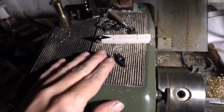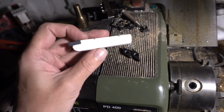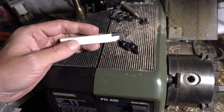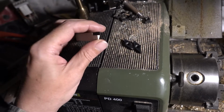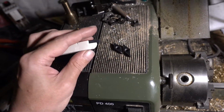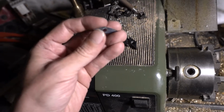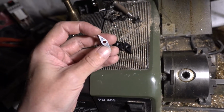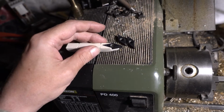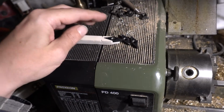Well, I was tinkering around a little bit, and it's Friday now, and I had to do a lot of other things, but this is now dried. I mean, yeah, it's set before, but with plaster, you also want it to be dry. I have to replace that broken out tip and then make a mold. I'll also try to cover this in a layer of graphite, I think with a pencil or something, to increase my chance to be able to remove that from the casting. Carbide can be brazed, so I want to put some kind of separation in there.